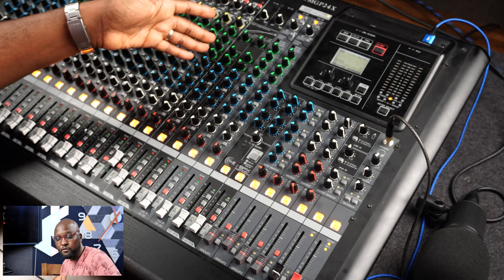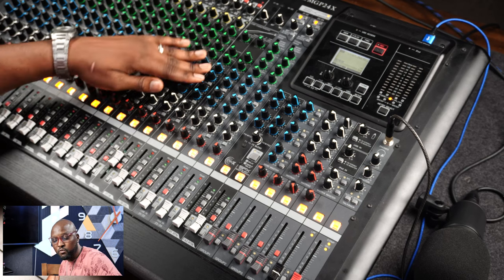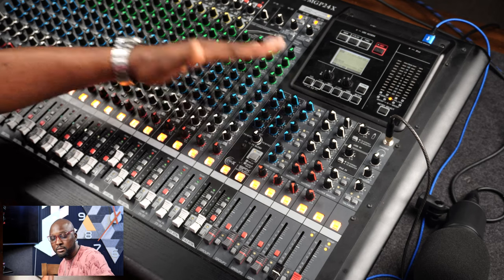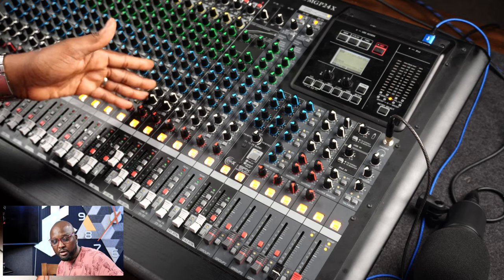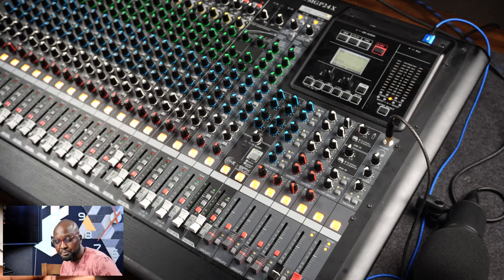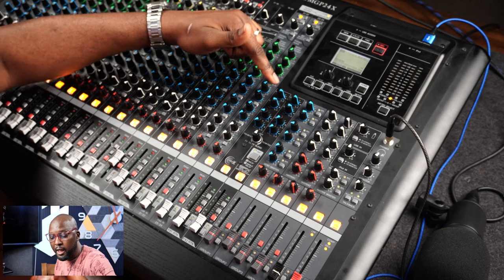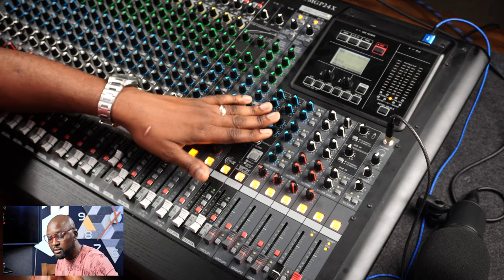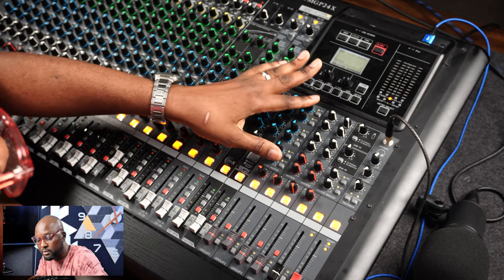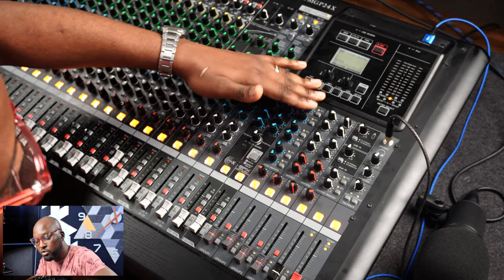It processes through the EQ. From the EQ, it will distribute the signal and feed all the auxes. The aux feeds go this way. They are not coming down this way anymore. They go this way to their masters. The rest will come in, it's going to feed the effect. Effect also goes to the master that comes down to the fader. So let's assume you have aux feeds. The aux will go this way. And we have portions of this. This will be the final output for aux 1, aux 2, aux 3, 4, 5, 6. That will be their final output, okay, for the aux. They come this way all the way to this output, okay?